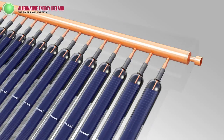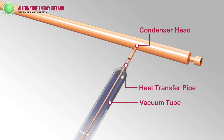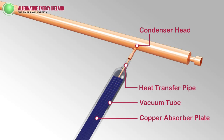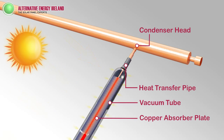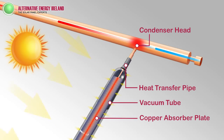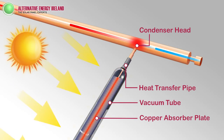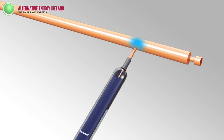This is where the magic happens. Each tube is a sealed system and operates independently of the other tubes. When daylight strikes the copper absorber plate, its temperature rises dramatically due to the patented coating. The heat naturally rises up the tube and gathers at the condenser. The cool blue coloured water comes up from your cylinder and passes over the hot condenser. There may be 30 or more condensers in each solar collector, heating the cylinder water for free during daylight hours.